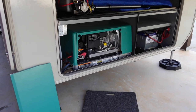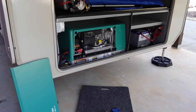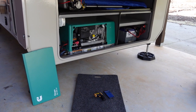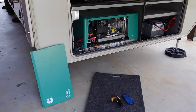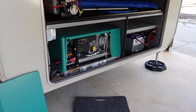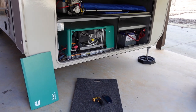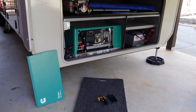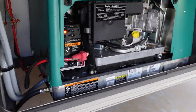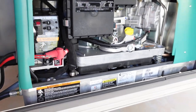Subtracting the two amp idle draw from 87, we get approximately 85 amps. That's 15 full amps less than the 100 amps it took to start up when the engine was completely cold — reading about 41–42 degrees on the engine block — compared to much warmer, in the seventies and eighties on the second go-round. That gives us an idea of the role temperature plays on starting the generator and how many amps are required.